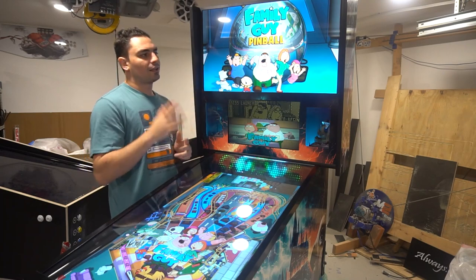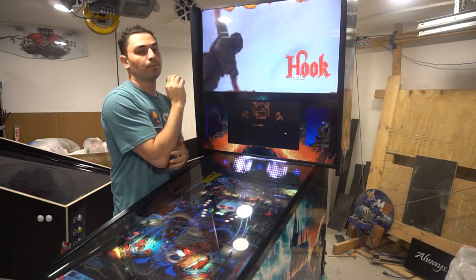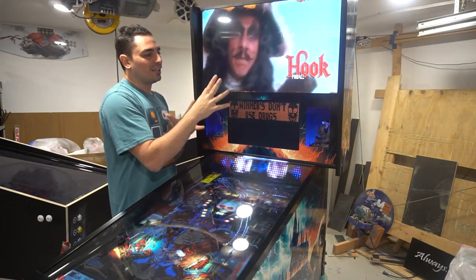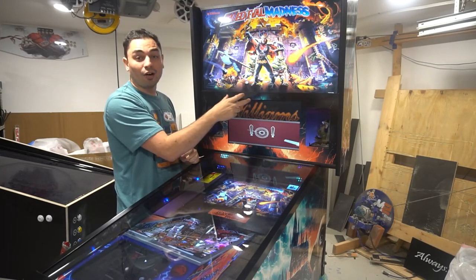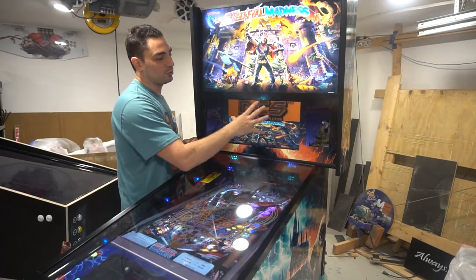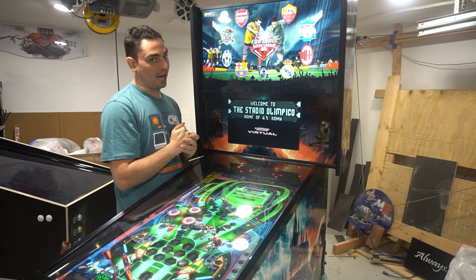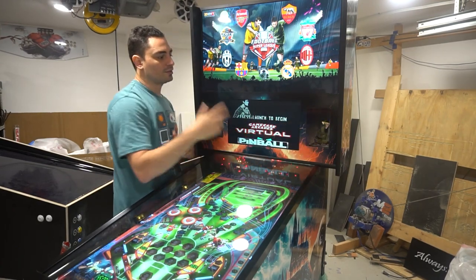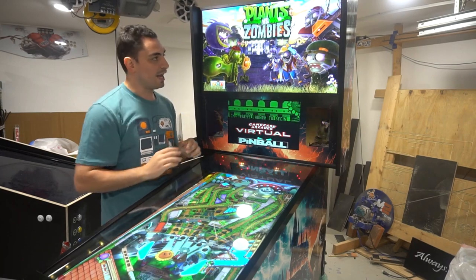Let's talk about the back glass and back box. The customer supplied this LG 32 inch screen, which does have a bezel — unlike the ViewSonics I use, which are virtually bezel-less except for the bottom. When it came to the DMD panel, this piece of wood is actually covering the bezel of the screen at the bottom. There's an LG logo there. My CNC skills have gotten a little better — the DMD screen cut is CNC'd out and it fits perfectly, though it was a challenge especially with where the connections are. There's plexiglass here as well — CNC'd the square out with a little outer edge so the plexiglass stays in place. It looks awesome.